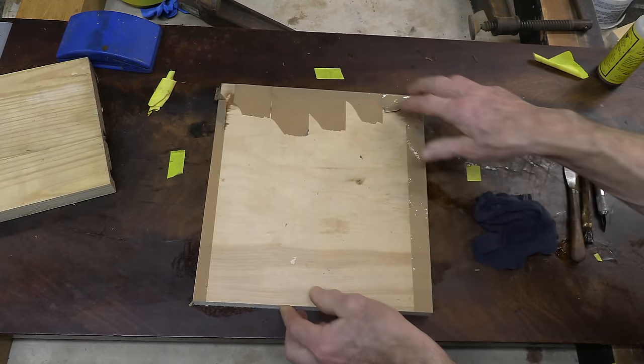Okay, I'm going to sand the top. Normally, I don't use a block or a sander because I don't want to flatten an antique top, but I will use a block to start off with in the patched areas, and I'm going to use 150. If that doesn't work, I may have to go to a coarser grit. I pretty quickly had to go to 100 grit, but it leveled off quickly. And I've got quite a few areas where my fit was good, but I do have areas that need Famowood.